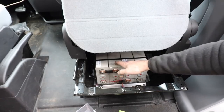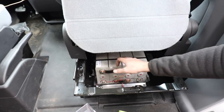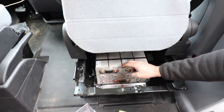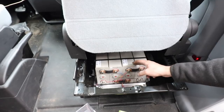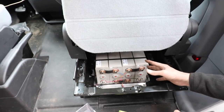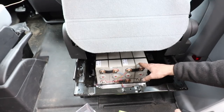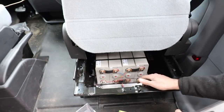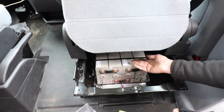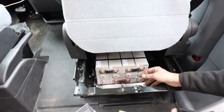You'll notice that this is four individual cells - these are three volt each: three, six, nine, twelve. The reason why we went with individual cells is that if one of these goes bad or comes out of balance, we can simply pull it out and swap it out at a quarter of the cost of what the whole battery would be. That's usually what happens - in a battery the whole thing doesn't fail; one plate or one portion of it will fail and takes the whole thing with it. It's like those old Christmas lights where one bulb goes out and they all go out. This way we could just unplug that and put a new one in for a quarter of the cost.